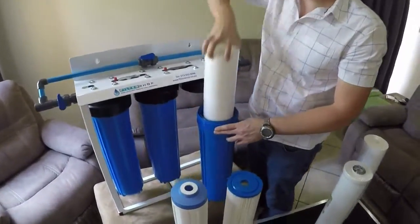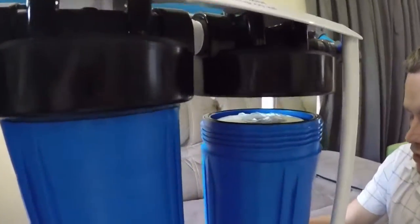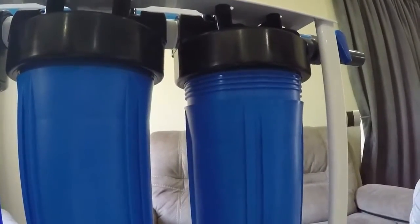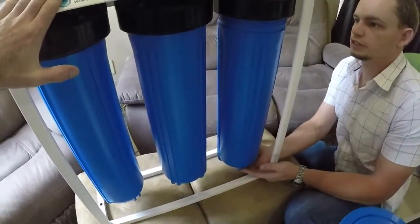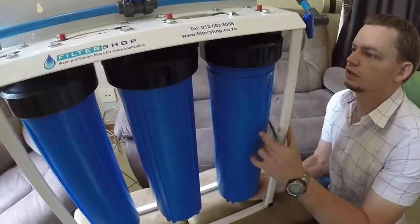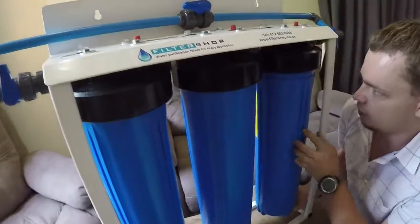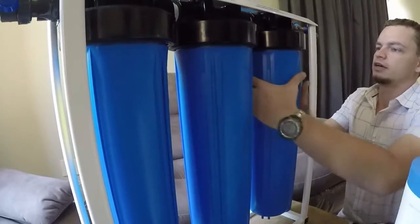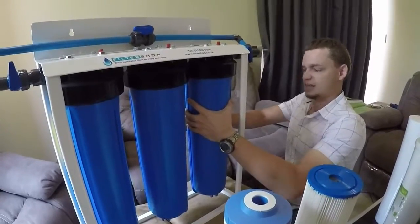And then you'd take the new filter, which you want to put in the housing, place it inside. And a nice thing to do to get it to line up is I always like to balance it on a finger at the bottom, so you have some pressure pushing up against it, and then take my other hand and turn it just gently to make sure that it doesn't get cross-threaded until you find the thread of the housing, and then when it grips, you can just close it.